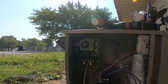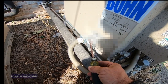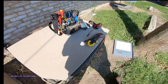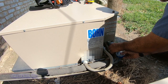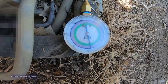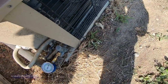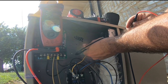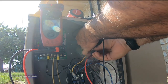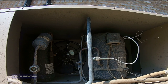She just went down into a pump down, at least it seemed like it. We can feel the magnet kicking on, so we know it's calling. It should be running, so I'm going to check the pressure switch — or it could be the thermal. The thermal is closed, so we're down to the safety switch: we have a high pressure switch and a low pressure switch.